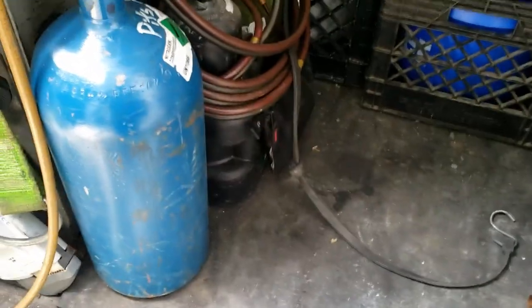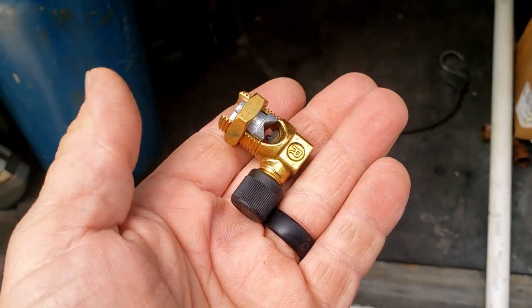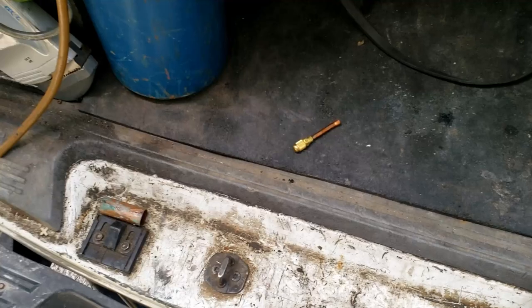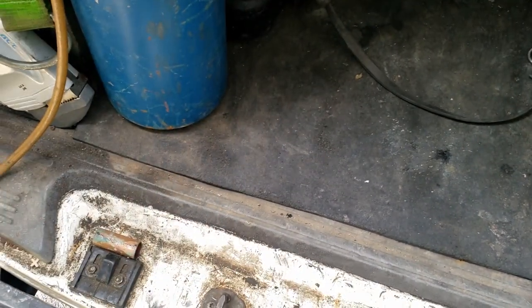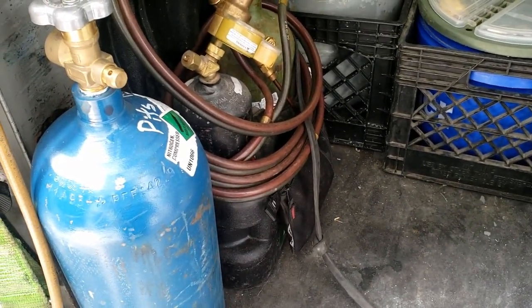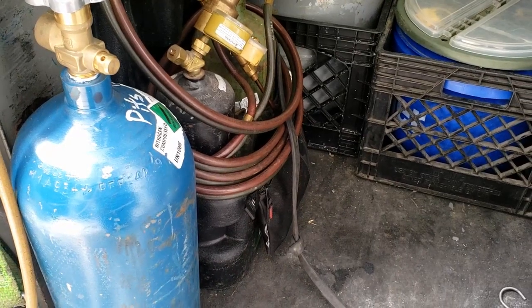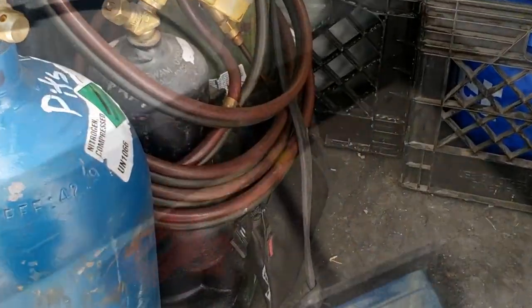The thermostat did turn on and off, which is good. According to what they're telling me it just started doing this last week and had been doing pretty good. We're going to put a tap on there — something easy to put on and take off — to see what the suction pressure is getting down to. If it's low, we'll pull the refrigerant out and solder on a permanent one using my swage tool. We'll also do a leak scan first to make sure there are no major leaks. The system only holds 12 ounces.